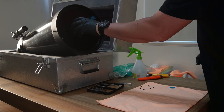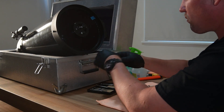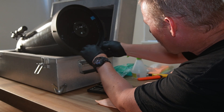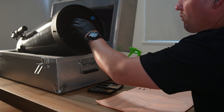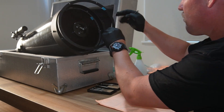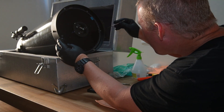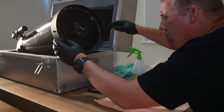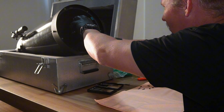Now that the screws are out, we need to pop that inner ring very, very carefully. I just use a small blade screwdriver down the side of it to try and shimmy it loose a little bit, because you don't want to scratch the glass, you don't want to damage anything. It took a bit of doing but I eventually worked out how to get it. That's the ring that holds in the corrector plate. Now I'm gently holding it by the secondary mirror. There is actually cork packing against the edge of the corrector plate around the outer ring to stop the plate shifting, so I basically have to pry those little bits of cork packing out, and then the corrector plate just pops out.